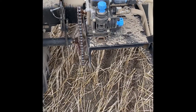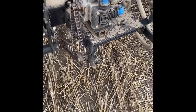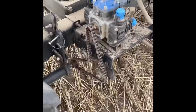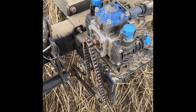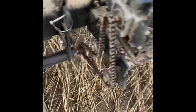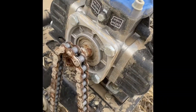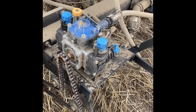This thing came with a big piston pump that would do like 100 gallons an acre, which was way more than we needed, so we replaced it with a John Blue 43 PVA poly piston pump. We actually have two of these. Last year we had something come uncorked on this pump, so it was good to have an extra. This pump has been really consistent at putting out five gallons of product. It's driven off a gear drive off the inside wheel of this tender, then comes up into a gear drive here. We put a bigger sprocket on to speed it up a bit because we were having trouble getting five gallons out.